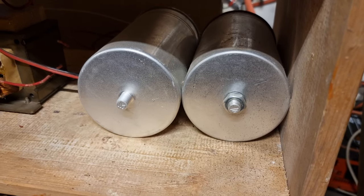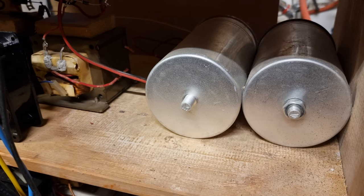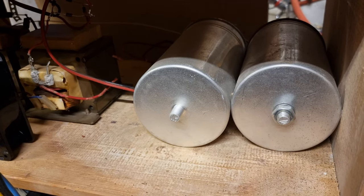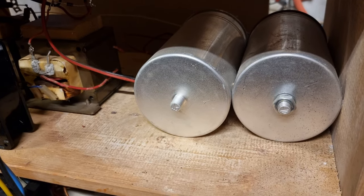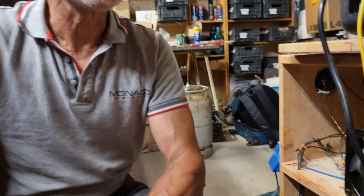It's absolutely not normal, and that's what I can see here as well. It's not normal because the voltage can go up high enough to trigger the process, but then when the process starts, it can go even back to maximum current, and then the voltage goes to zero. So it's strange, but then the process still works.